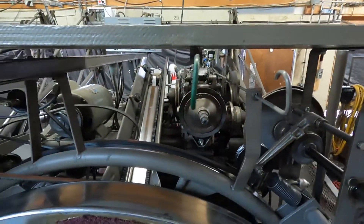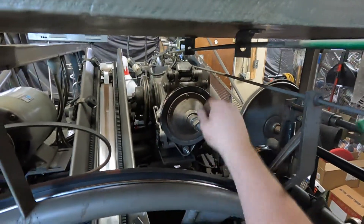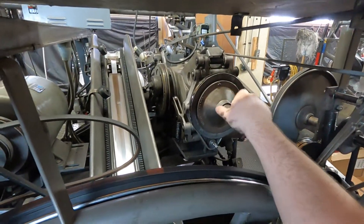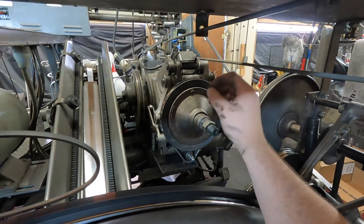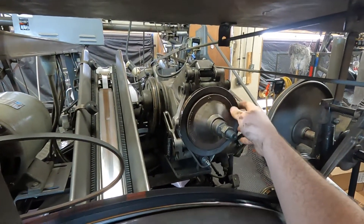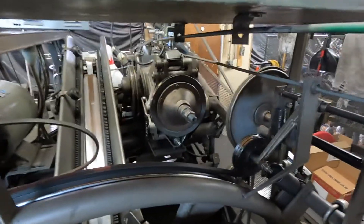That's in, and now you can see it's not moving anymore. Because this was loose, some of the plates got loose. There is some play side to side still, which tells me the splines on the shaft might be a little bit worn. But the play back and forth is gone, and that short adjustment makes a difference like everything else does.